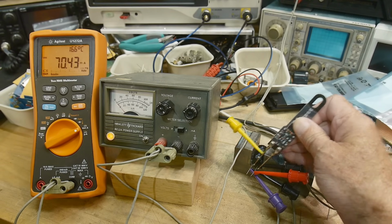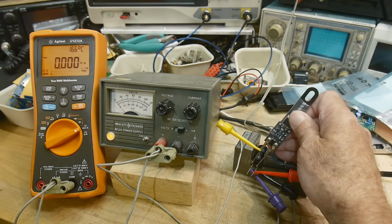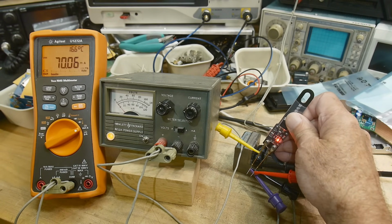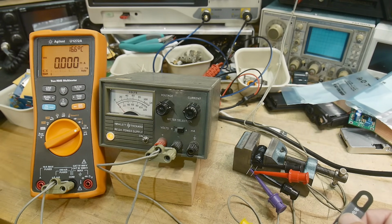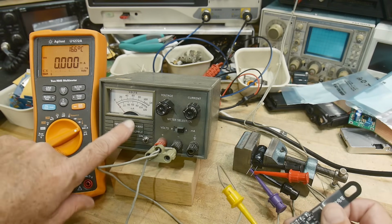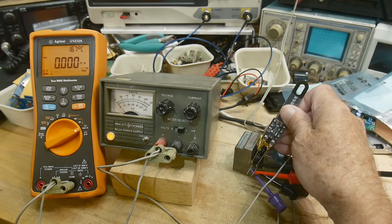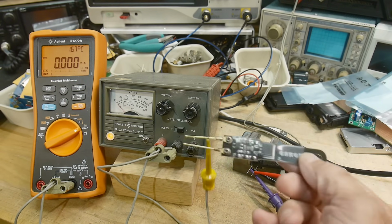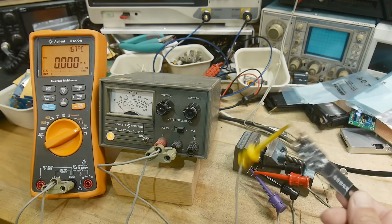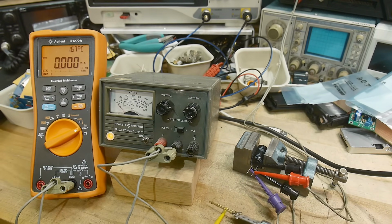But with that 7.5 ohm resistor in there, it should have been somewhere around 100. But it seems like it's around 70, and we sort of got 80 with one-digit resolution on the other power supply. So I think I need to calibrate this one for milliamps. I don't think it's measuring correctly, but it goes to about 70 milliamps, so that's what this thing discharges at. And like I said, it has a feedback loop on it, so it doesn't ever go above that discharge current.